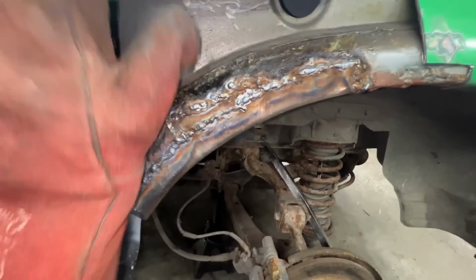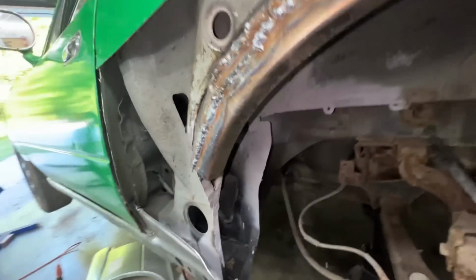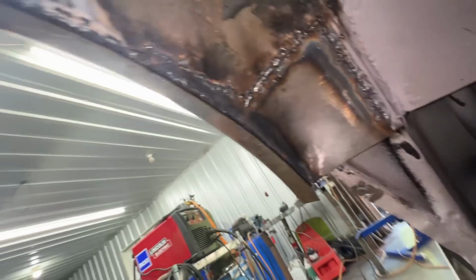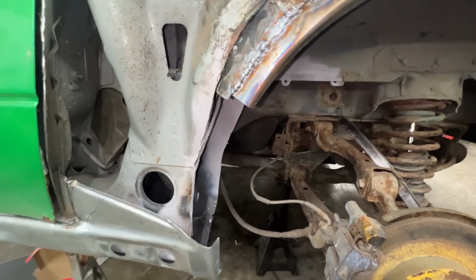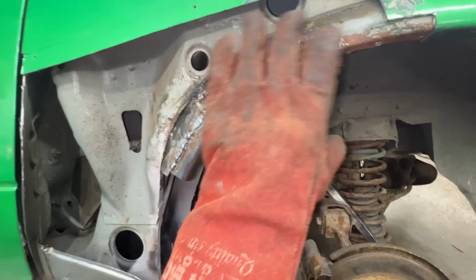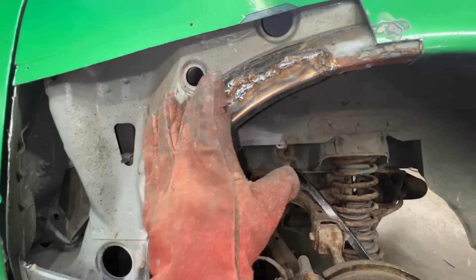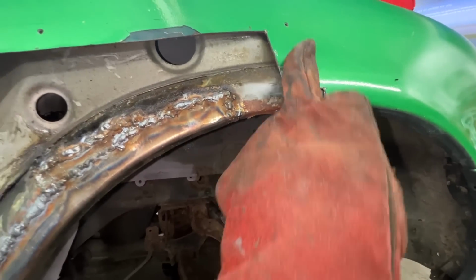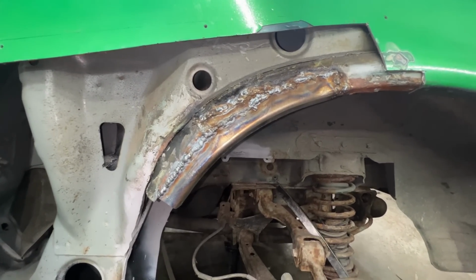What is this? Oh, this is just a piece of wire here. We're gonna grind it off. And inside looks good. So I'm just gonna cut it like this now to make, maybe not, I don't know. I'm gonna grind it a little bit because this side, this stitch at least, needs to be ground well. And even here, these are pretty high. Because you see how the outer fender follows this shape. So I'm gonna grind it nicely.